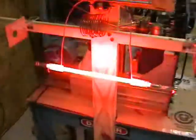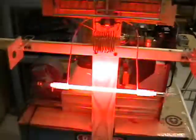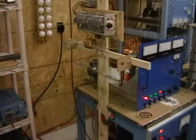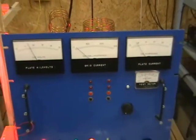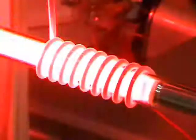And lo and behold, we now have high power operation of our Rife tube, which is now running at approximately 450 to 500 watts. Because the tube cannot handle continuous power, we're pulsing it at a 50% duty cycle. A larger tube may be installed to operate at full power, and we will also be able to raise the power level on the amplifier to approximately 500 to 1,000 watts if necessary. As you can see, it operates very nicely, produces a large amount of power, and works quite well.